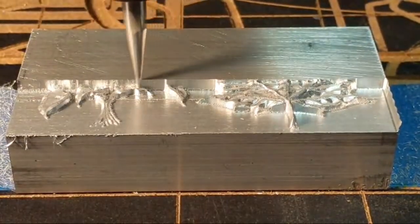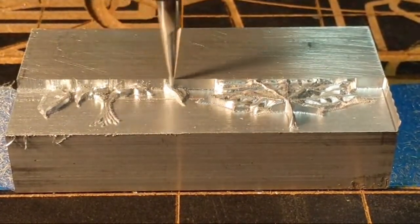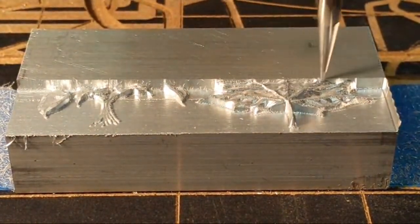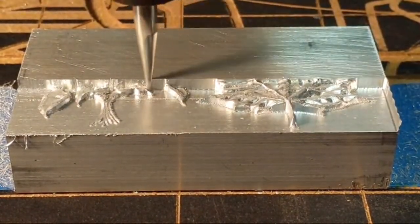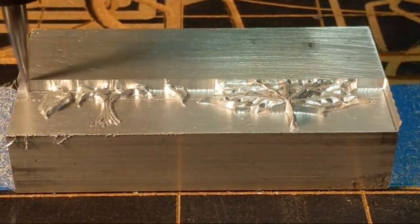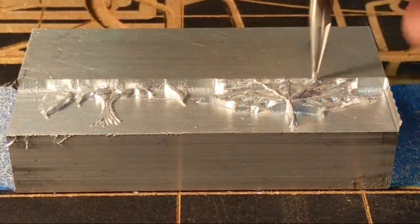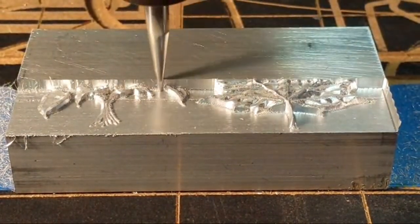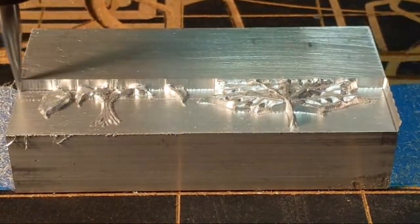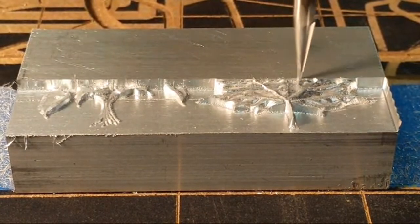All things have natural frequencies. And so you can get into those natural frequencies. That's a little bit different from chatter, but technically chatter is when you're surpassing the capability of a piece of equipment. The tool is too long and you start getting what they call tool deflection. All router bits, all tools that cut, they have a deflection in them.